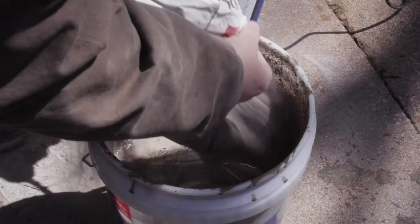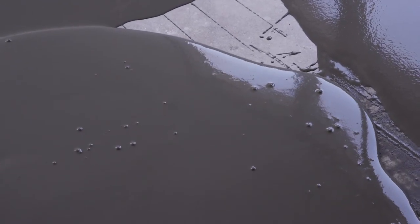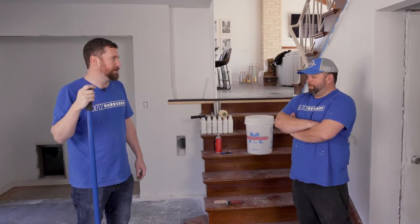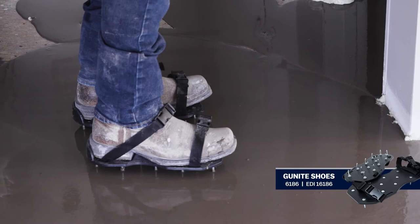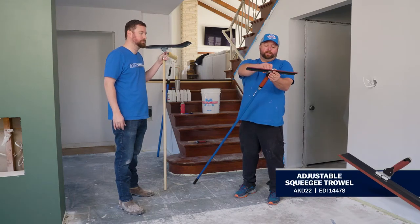The underlayment is a standard product available at most hardware stores. We'll mix two or three buckets before pouring anything down to see if we're finding the low spot. It flows like water — no troweling or gauge rake needed. We'll start near the low spot, let it find its level there, then pull away from it with our buckets. We want to make sure we end up exiting and not trapped in a corner.